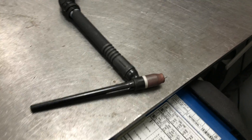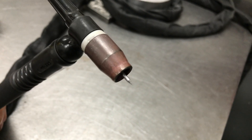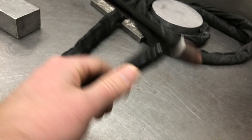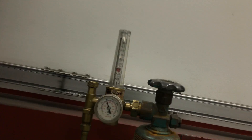This is what you call your torch. At the end of your torch is your tungsten. Mine's sharpened to a nice point because we're going to be welding steel — you might want something a little bit flatter for aluminum. This is a small torch head; I really like it, it's a Weldcraft torch. It bends right here — you don't want to bend it too many times because they will break eventually. If I hit my pedal, the ball came up and we're running about 20 CFH.